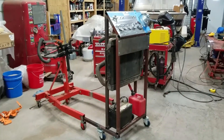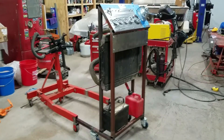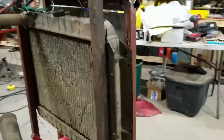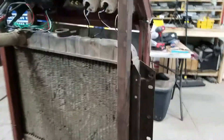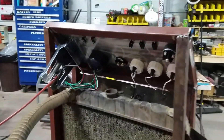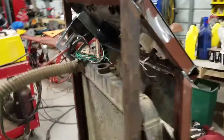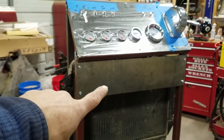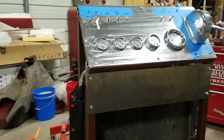I did a bunch of welding and I kind of got in a hurry, so I got it a little unsquared, but that's okay. Looking at the radiator, it's in there just mocked up with some baling wire. I'm going to have to put in a couple of L brackets to attach it on each side. You can see how close the fill neck is — right in there. I've got the dashboard up there and I've also got this extra panel, which is going to house all of my breakers, relays, and that's all going to be on the back side. And there's a perfect amount of room to put both my electric fans in there.